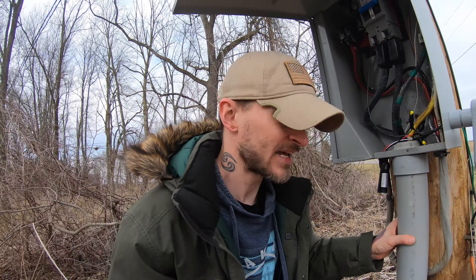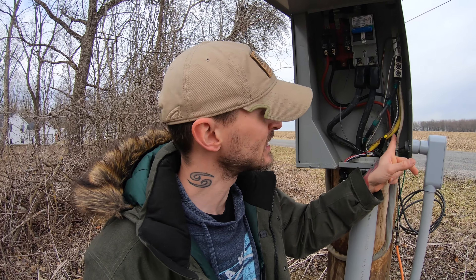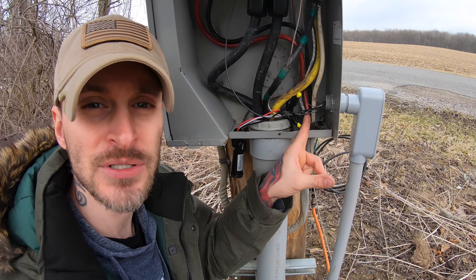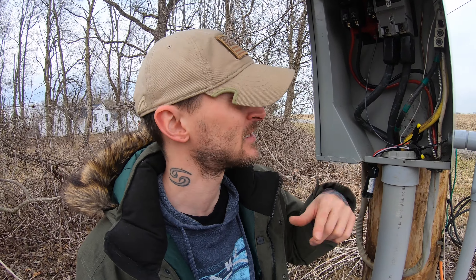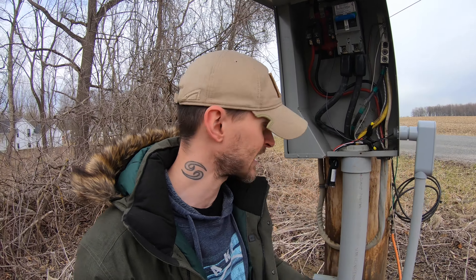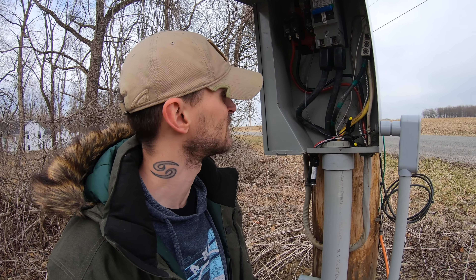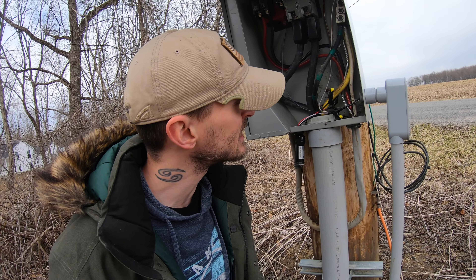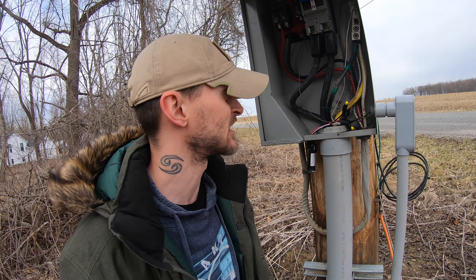All right, fingers crossed — I think I fixed it. I don't see any damage on the two blacks, the yellow neutral, or the main ground. It was really just on these 14-gauge wires here. I cut them all back, cut the bad spots out where the clear coating around the black was a little bit frayed. I did put some electrical tape all around that, and then I just electrical taped those wires back together. I blew it out with the blower, turned it on, and the lights did turn on for like one second, and then once the photo cell registered, they went ahead and turned back off. I think for right now everything is good. All of the wires have now been replaced with new going up to everywhere.